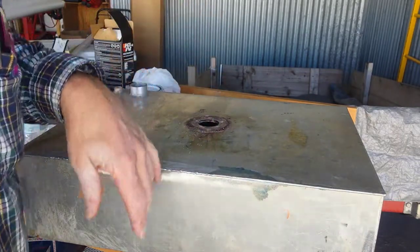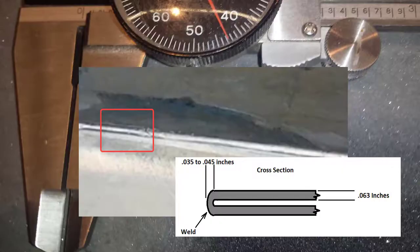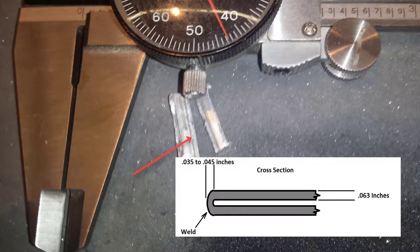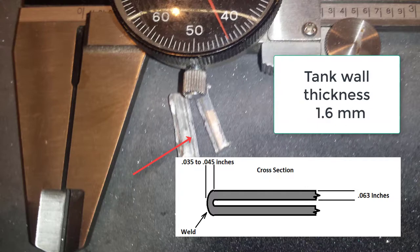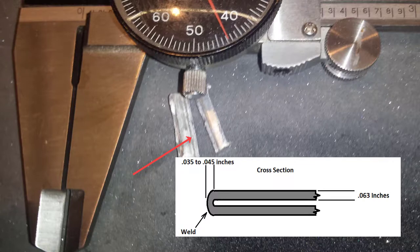Let's look at the other tank and see what I've done to change that. I cut a chunk out of the flange of the tank in that red square, and those are the pieces I cut out. You can see where that arrow's pointing — that's the depth of the weld coming in from the edge. Playing with calipers, looks like I got about 43 thousandths of an inch. Some spots it was closer to 30 — hard to measure. So that kind of backs up my theory that there was inadequate penetration into that weld, and that's why it was cracking.